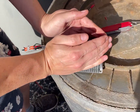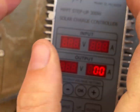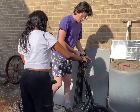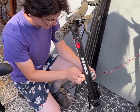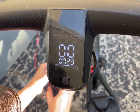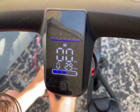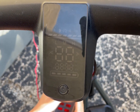Let's see — oh, we got voltage! It's really hard to see but we do have a reading. We're standing in front of the solar panel, so you can see that. I'm going to set it down to 36 volts — wow, I can actually do that. I can go down to 36 volts, this is so cool. I'm going down to 40 volts and plugging it in — and the scooter is off because it's charging. It's charging at 0.26 amps. That is so cool.